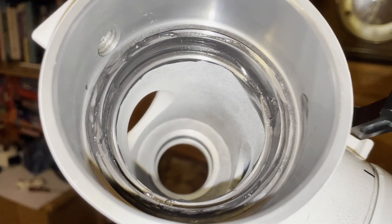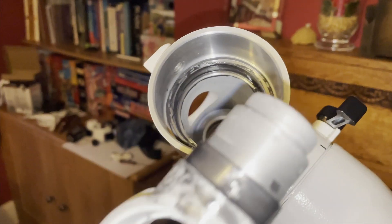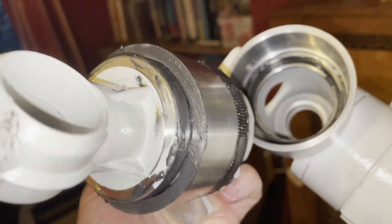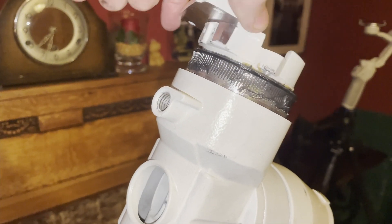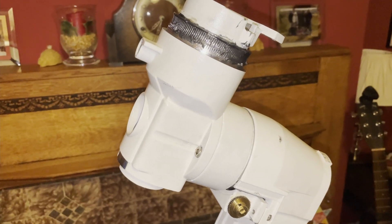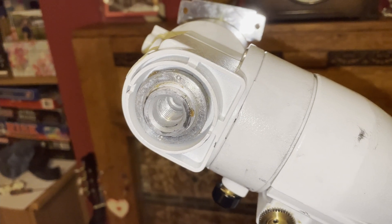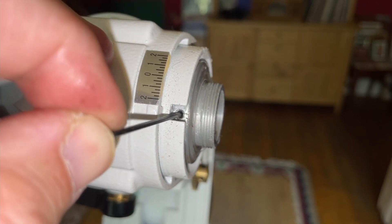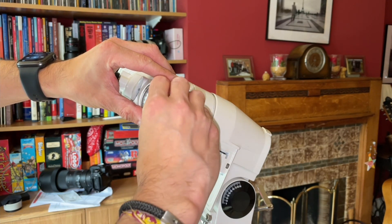With the right ascension axis already installed, I've then greased the declination axis — where the shaft goes through — using the standard axle grease. The shaft itself has the worm drive gearing and nylon washers already installed and greased up, making sure you've got the right grease in the big moving parts and the worm drive grease in the correct places. Here you can see the shaft is installed and I'm rotating it to spread the grease around the mechanism. I've then tightened up the declination axis with the circular ring, secured it using the eyepiece maintenance tool, tightened the two allen bolts to secure the rim, and put the setting circle back on with the ring in front to keep it in place.